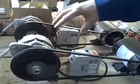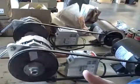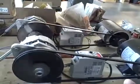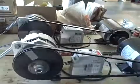We can push this even further — if I slowed this down too far, what would happen is one generator would eventually be pulling so much torque and so much current to drive the other as a motor that it would literally pop out of sync. That's called slipping a pole. Slipping a pole on a generator is something you never want to do — in a real power system you get catastrophic currents. I'm not going to do it in our simulated system here. We also have no overcurrent protection built on the circuit, so there's no way to automatically detect a slipped pole condition.